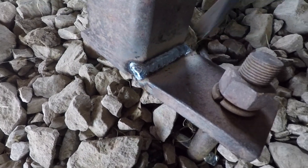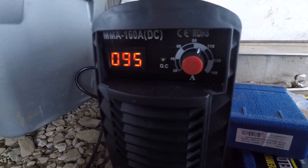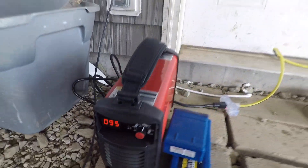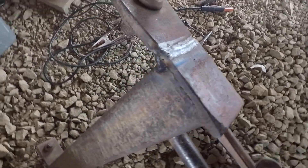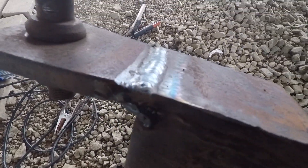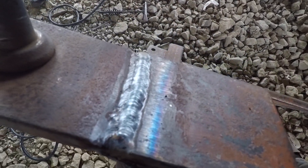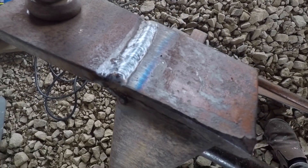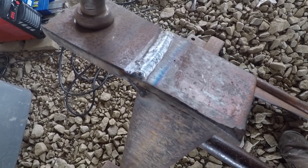That's why I'm a bonafide welder right there. I'm only running the machine at 95 amps — this thing goes up to 160 — so you get an idea of what you actually use to run this puppy. Got a couple more fillet welds to do, probably at least three more beads. We'll see.